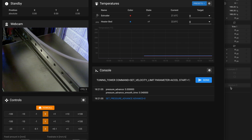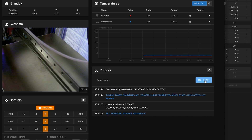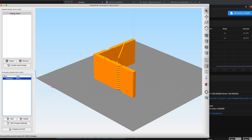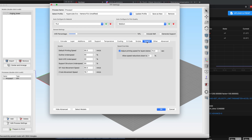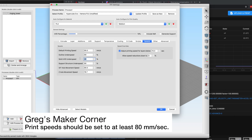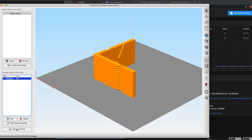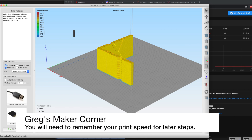We also need to set the tuning tower command — it's a pretty long command so I recommend copying and pasting it directly from the website. This command is going to steadily increase the acceleration and velocity of the printer. At this point you're going to need to go into your slicer and load your ghosting tower, and make sure that you have at least 80 millimeters per second for speed. You could go a little bit higher, but you want at least 80.